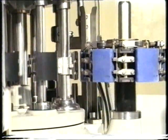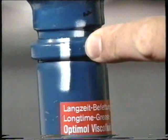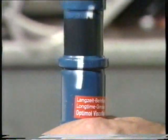If repeated errors occur at half the gripper pitch after the universal joint shaft has been exchanged, the alignment of the upper and lower universal joints of the cardan should be checked. This is also indicated by markings.